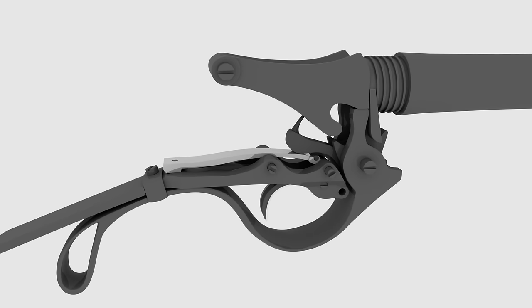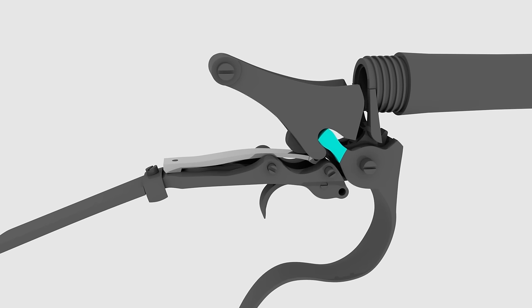Here is the breech block, with a slope cut in its top to allow for feeding and ejecting our cartridges. It's held up at its face by this combination lever and trigger guard, which sports a pair of extensions at its top near the breech face. Rocking the lever down not only releases the breech block, it also pushes the lever extensions against lower protrusions on the breech block, forcing it downward at its face, opening the action.